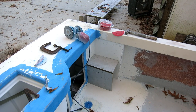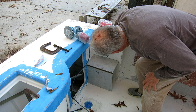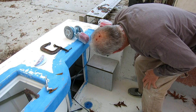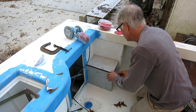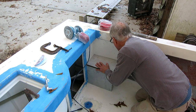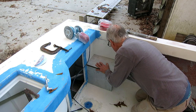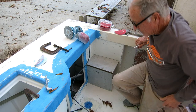If you've been following this build on YouTube, you might remember the blue epoxy paint that did not adhere well to the uncured polyester resin when I was doing the stringers. Well, it cures well to other epoxies and it sands easy, so I'm using the rest of it up as a fairing compound — mixing it with thickener and cleaning up some of these edges. I've got the step kind of set into place and the wall's a little lumpy, so I'm scribing it to trim the box and make it fit a little bit better.